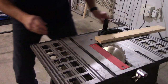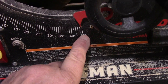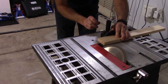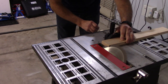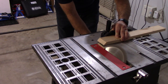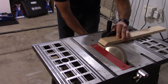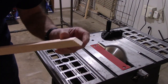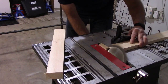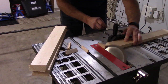I've turned the blade at an angle because we want to cut the wood at a 45-degree angle so we don't have a sharp edge sticking down. That way it'll be a nice clean finished project. We're going to do that to all three pieces of wood on both sides, so we need to make a couple of cuts. Once the cuts are made, you can see a nice clean cut — we'll clean it up with sandpaper later. Then we're ready to start assembling the tabletop.